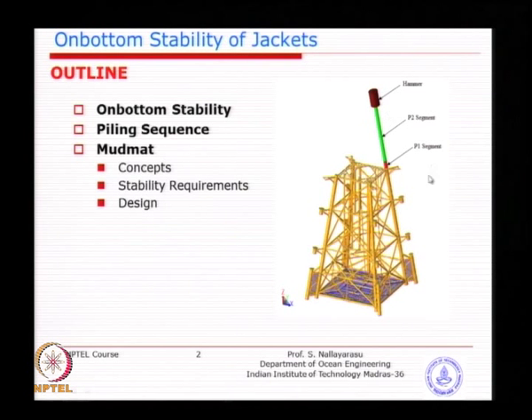This pile plus the hammer adds additional weight to the system. That weight needs to be transferred to the ground by means of simple bearing. You calculate the applied bearing stress due to weights and the allowable bearing stress due to soil strength, and compare whether the system is able to take the load or it is going to have undue displacement in the vertical direction — which is what needs to be prevented.